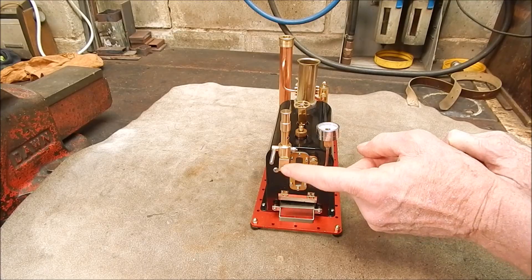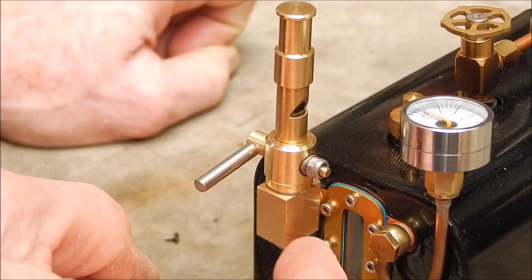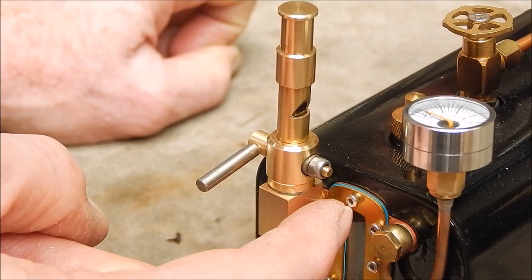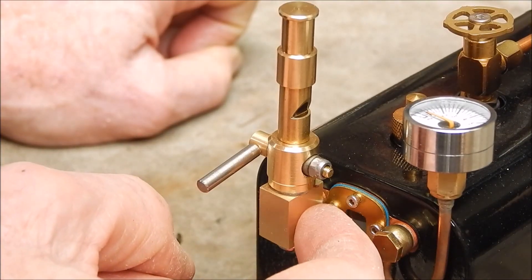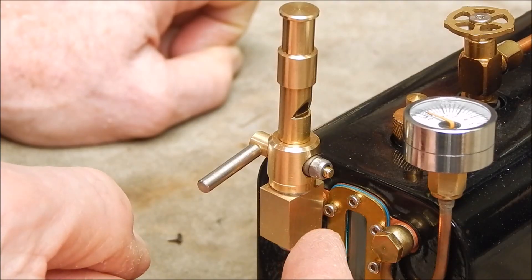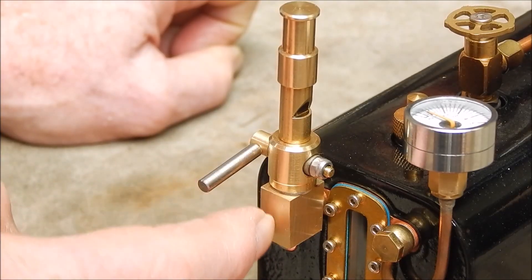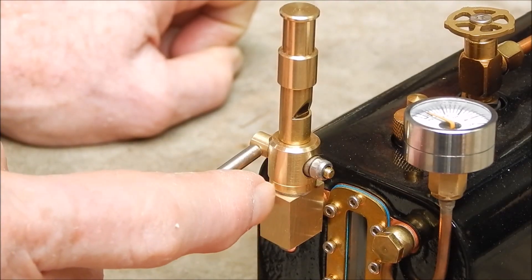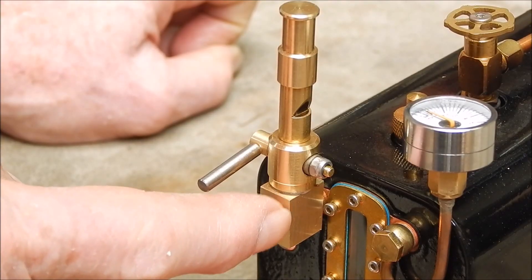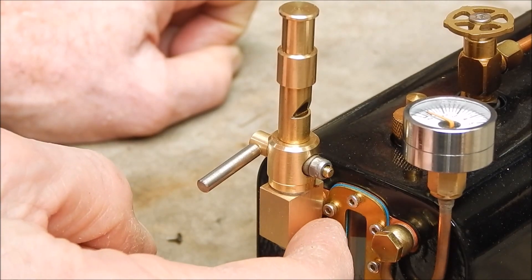All I had to do was make up a union, and that's quite easily done. The union is basically a bit of square or rectangular brass. I machined one end of it into a 5mm end, because that's basically a 5mm x 0.5mm thread — very fine thread, about 40 TPI in the old imperial terms, but it is metric. So you want 5mm diameter with 0.5 pitch. Then just a matter of drill and tap down vertically for the whistle, and that is 3/8 SAE. But I didn't have the 5mm metric tap in 0.5.